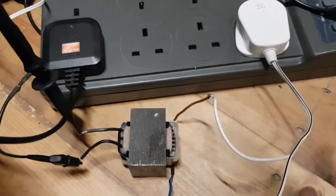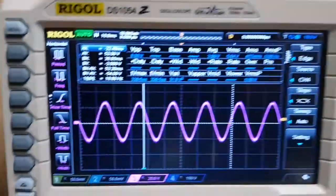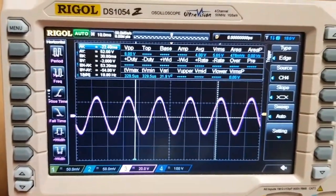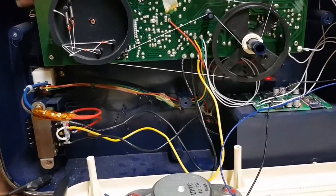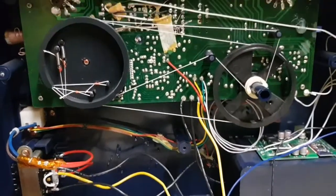I'm going to play. Do not try this at home. I'm a professional idiot. So plug socket, exposed solder connections, transformer, oscilloscope, and my sine wave is looking very nice and clean. So that suggests the inverter is actually putting out a nice decent sine wave. Worrying why this isn't showing that. Maybe it is clipping and it's just putting some really horrible artifacts on the transformer.